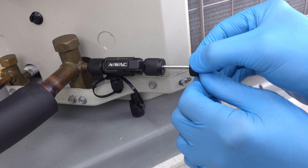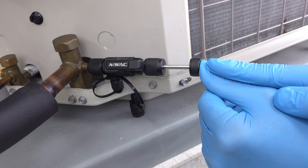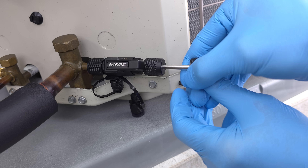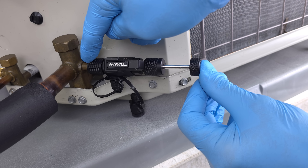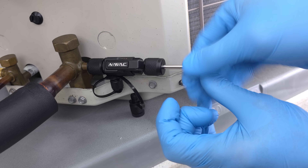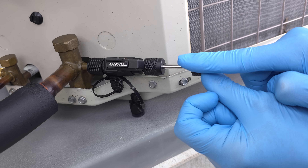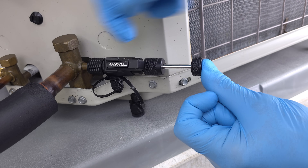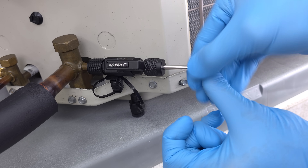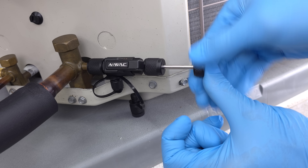We fell into the valve core, and now we're going to be applying pressure inwards because we're fighting the pressure exerted by the R410A once it's coming around the valve core. As we're unscrewing this out, the seal is no longer holding it in place, so we're applying pressure inwards to go against the R410A pressure pushing outwards. We're going to do this until we hear a click, which means the valve core has exited the threads of the port.